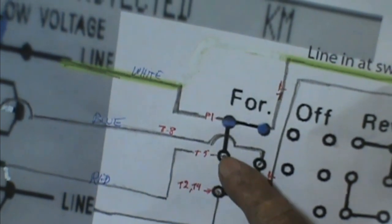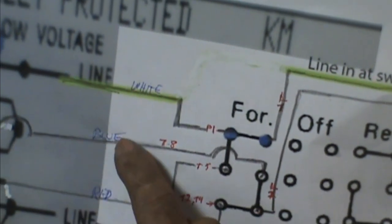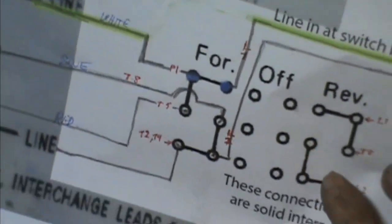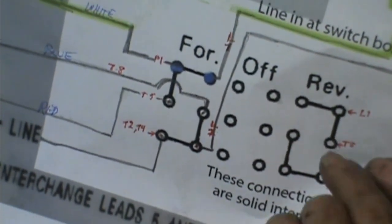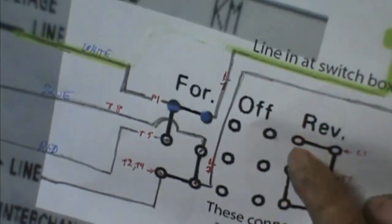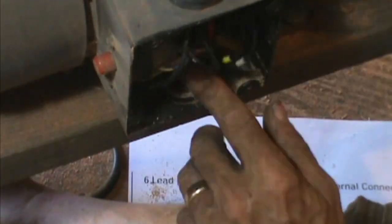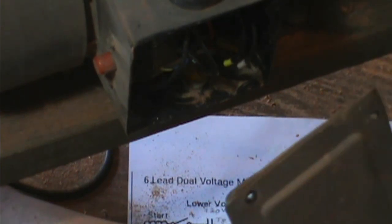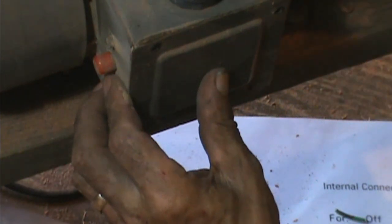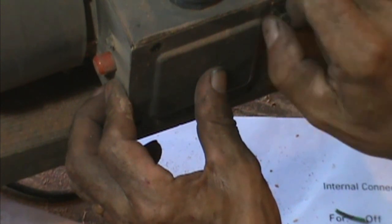So I have the red wire that's going to hook up to the three position, and I've got the blue wire that jumps over and comes up to the four position. If you look at this side, you can see that depending on the position of the switch it powers one pole or the other but never both. So at this point I'm ready to close up this plate and put everything back. I don't need to open up this box again for anything else.